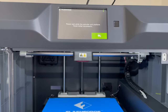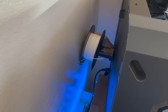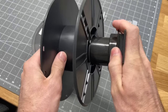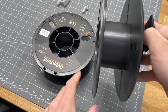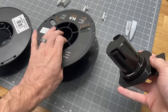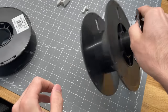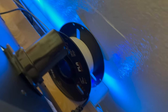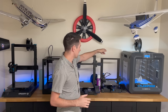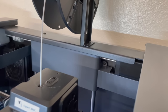The biggest problem I had was the spool holder. It mounts on the back of the printer and has a clip that only works with certain rolls — I had some Anycubic PLA that worked, but the Overture PLA I used for the build just fell right off the back. So the first time I checked after printing the first part, the spool was just laying behind the printer. I used a spare spool holder from the Ender 3 — there's just one screw up top I loosen to attach the spool on top of the printer.